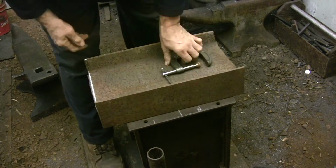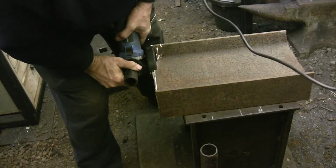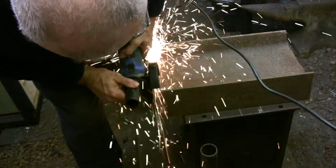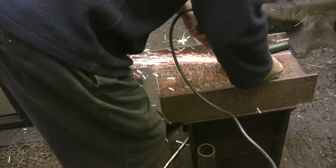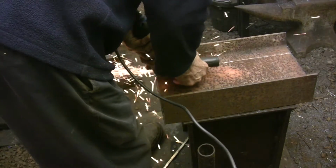If I needed to cut the beam to length from a much longer beam, I would use the same technique. The only difference is I would need to slide the square vertically in the saw cut to be able to mark the center flange. And I would use a sawzall with a metal cutting blade to cut through any part of the flange that I wasn't able to reach with the grinder.